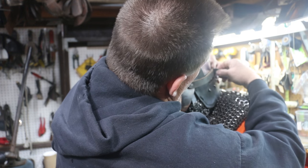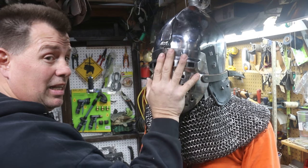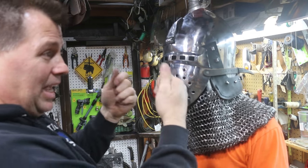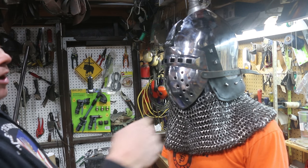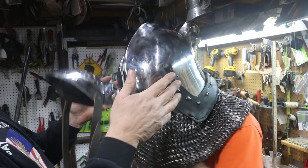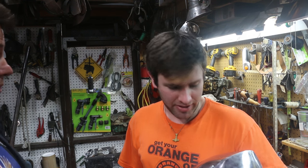Now I'm going to cut off this strap so it's hanging down — not quite all the way below the aventail — but long enough to easily grab and manipulate. At this point when we put the visor down, let's go ahead and buckle this thing down the way it's going to be. The nice part about this design is that when you push forward the helmet is not allowed to come forward, and this helmet can't be lifted off your head. You don't need to really cinch it down super tight in either direction. The strap that goes over the D-ring and then back down ends up locking together so the strap itself doesn't slide or move — very comfortable and easy to do. To take off the chin strap, I take my thumb and just pop the chin strap off, then slide the helmet off your head. You don't need to fiddle with the buckle at all.